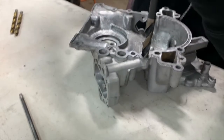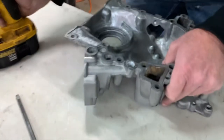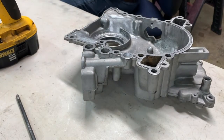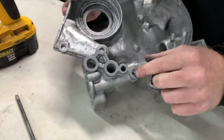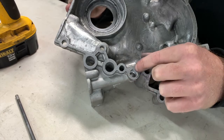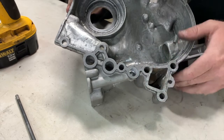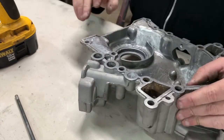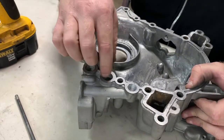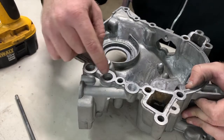All right, so now we're at the bottom. The easy thing to do is suck all that crap out with a vacuum. As you can see, we now have a 9/16 hole with quite a bit of sealing surface area around it. We will have to bevel this hole so there are no sharp edges sticking up to keep it from sealing on the motor. If I didn't have this later timing cover, I would have to drill all these holes and then radius and chamfer all the turns.